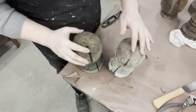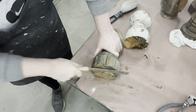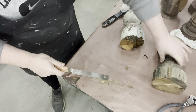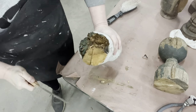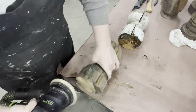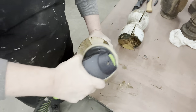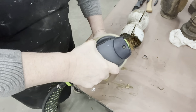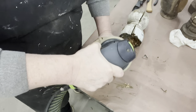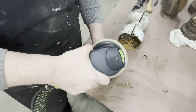In my area, I'm not lucky enough to find a ton of salvaged pieces, so when I do, even if they're a little worse for wear, I'm going to pick them up. These were picked from the hoarder's warehouse, so they need a bit of work, especially since they don't stand up on their own. So first, I just took the Japanese saw, got that little area that needed cut off, and now I'm sanding so they will stand flat.